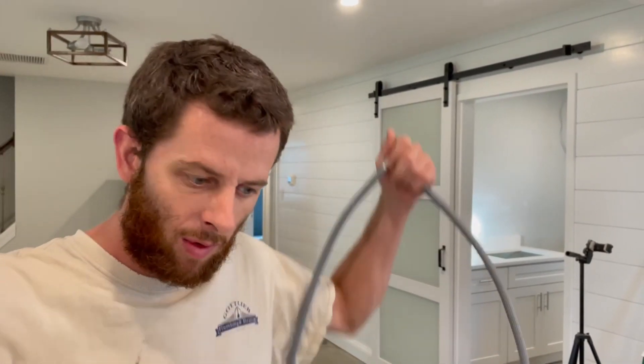In order to drain, we put valves underneath. It's on the first floor, so you turn the water off and then open your faucet. You've got to open upstairs too to let air flow and let it all drain down. It's like holding your finger on a straw in a soda — you need airflow up top to drain the whole house. Open everything up, let it drain all the way down including hose bibs, then you can install your valve.